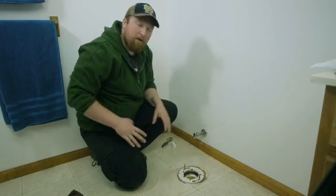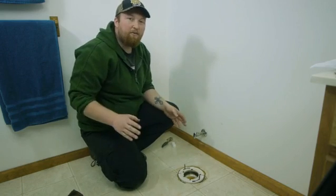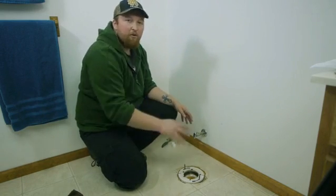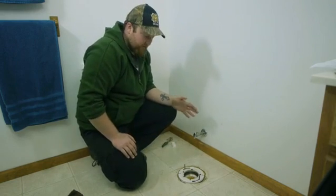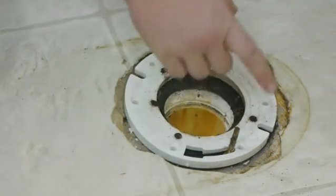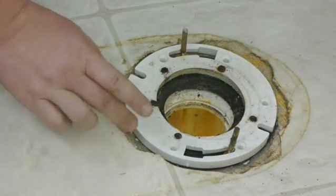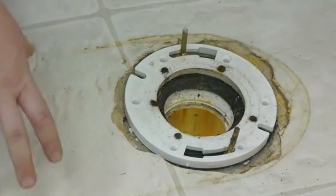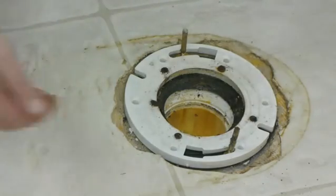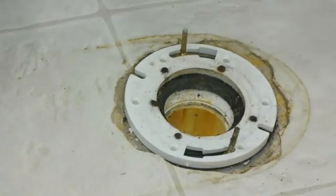One way is pulling the toilet up. I like doing it this way because you can have a nice tight fit with no cracks, no caulk under your toilet. So, you have to pull your toilet up, and if you see here, you can actually leave a little bit of gap around your flange here at your toilet, because when you set your toilet back down, it's going to cover it all and hide it. Then you can have a nice tight seal on the outside with no caulk.